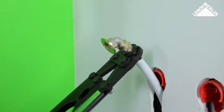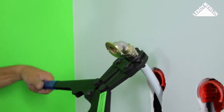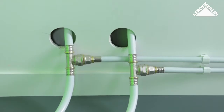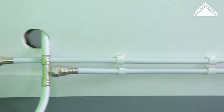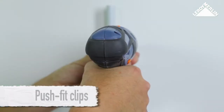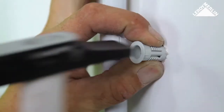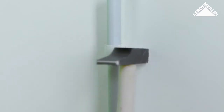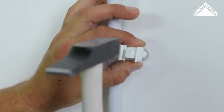Connect up the mounting bases, then install them by pulling out the pipes at the bottom. Use a reducing T-joint on the water supply pipes which go to the sink via a 16mm pipe. Special push-fit wall clips hold the pipe against the wall. Drill, then tap the head so the plug sits snugly in the drill hole.